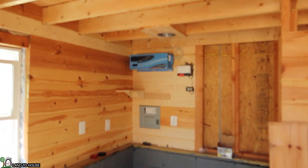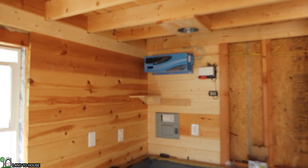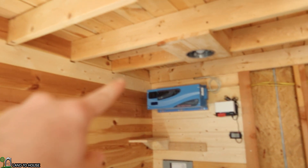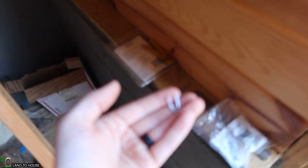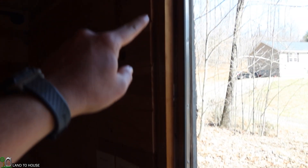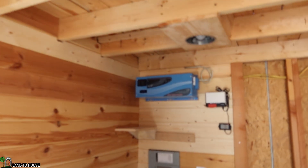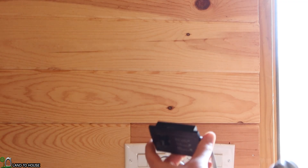When you step into the tiny house, the electric is going to be up here on the back wall, and I don't really want to have to walk over there and find the switch on the top of that inverter. So I'm going to run the remote switch from this back corner up over under this two by six here, across the door, and come right down here to probably this spot right here. I'm just going to put a couple of these staples to keep that cord up along this door, and then maybe one over here in the corner, and maybe one more somewhere midway to keep it taut. Let's start there first and get this remote installed. I think I'll start from the door and move backwards.